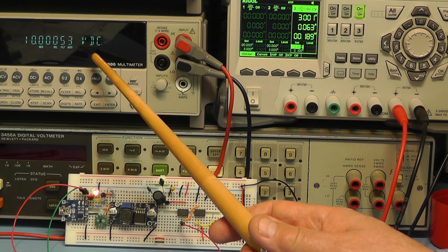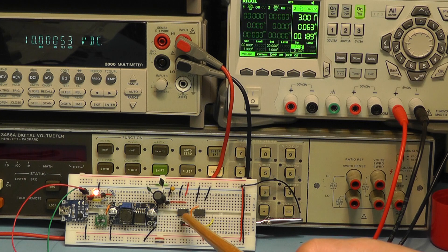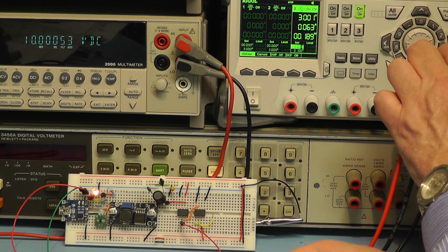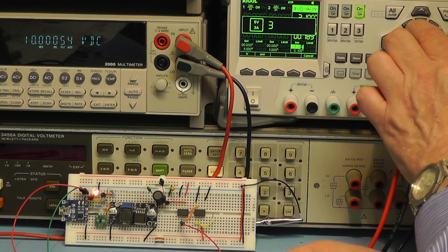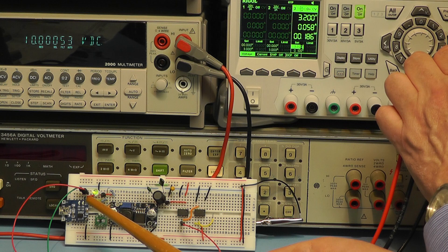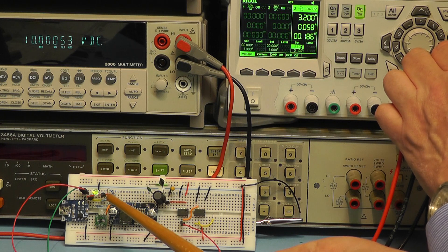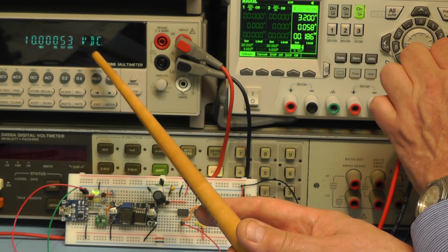The meter is displaying the reference voltage and it's reading 10.00053 volts - that's without any adjustment on that particular IC. If I increase the voltage to 3.1 volts going into the unit the LED is still showing red; at 3.2 volts it's gone green. This particular unit will actually work quite satisfactorily and still give you a good reference voltage even on the lower input voltages - the meter reading throughout has been fairly constant at 10 volts.